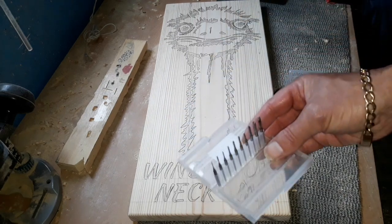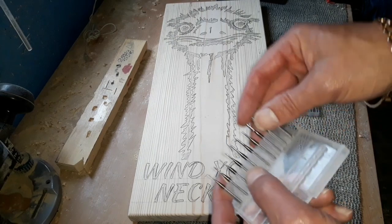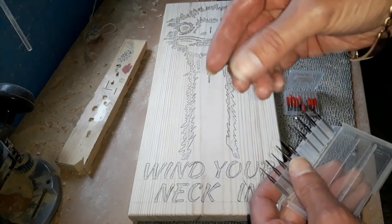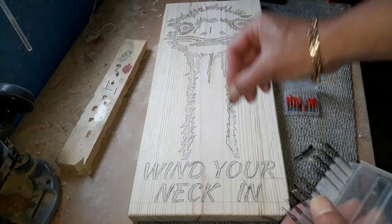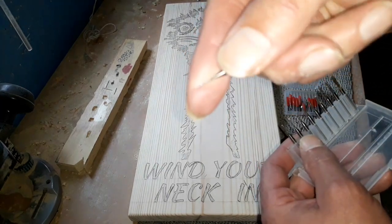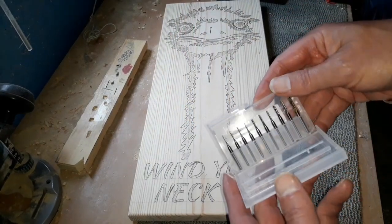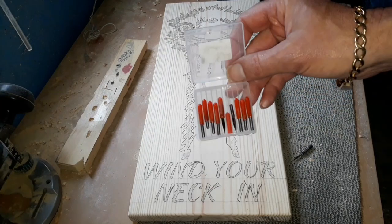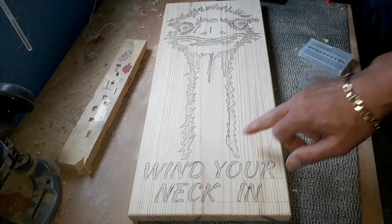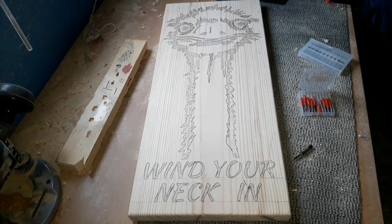When we're coming in with another bit to clean out the darkened area, we won't have any issues with small pieces popping off. For that I'm going to use these carbide end mill engraving bits — if you search 'mill end bits CNC' on eBay you'll find plenty of them. They're quite new to me but I've used them twice and they're lovely for cleaning out the inner area. They come in different sizes; the smallest one like a pin I think would break as soon as you put it in the wood. So we'll clear it all out with those, then put black paint on and sand it down.